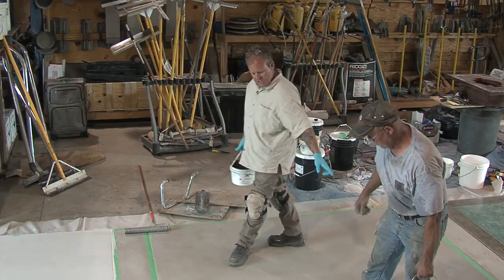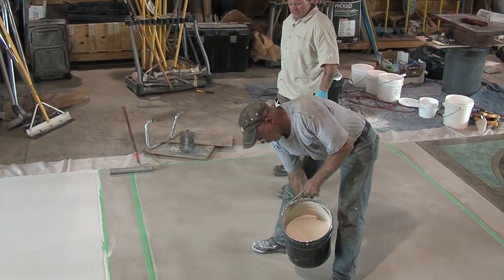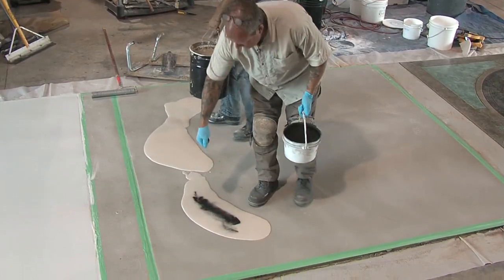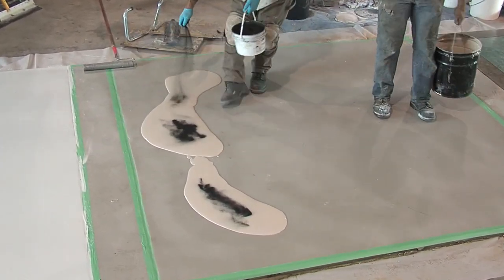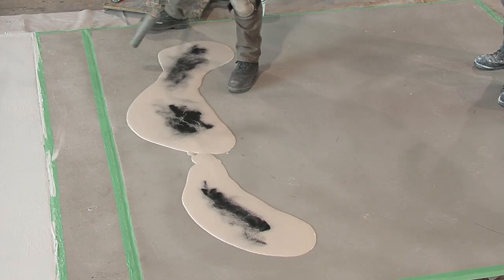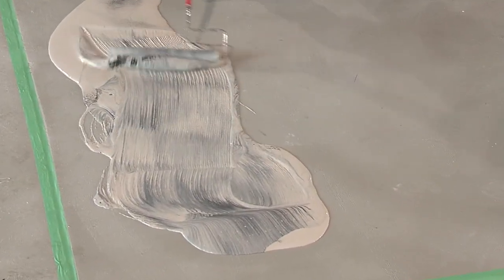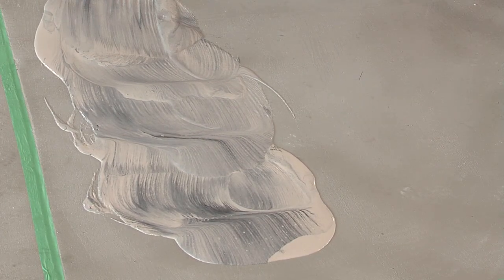One of the elements that makes this product so unique is the coloring system. Ron is going to go ahead and dump a ribbon right along the border, roughly six to eight inches away, and keep pouring as we go. Then I'm going to come back and use this one simple way of coloring it — you can simply broadcast coloring right into the material wet, and then we'll blend the color with a roller. This gives it a real subtle marbleized effect, and it's that easy to get some really interesting color effects.